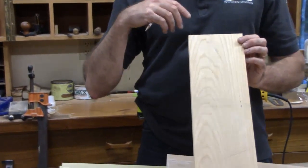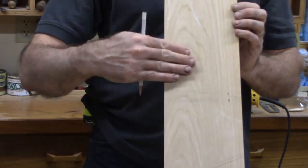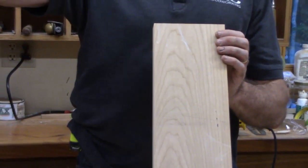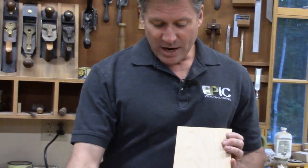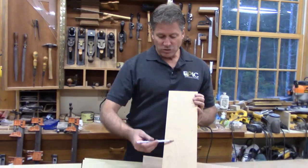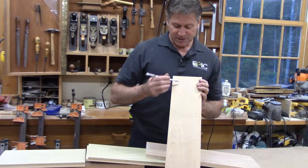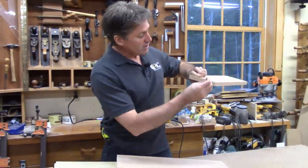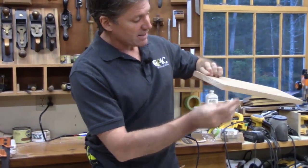That's the plane sawn area of the board. It's sawn in the same plane as the growth rings, if you think of looking at the end view. Its signature element are these arcing figures, often called cathedral figure. That's pretty much the center. When you look on the end of a board, you're going to see the growth rings centered on that arc. So in this case, it's like this.